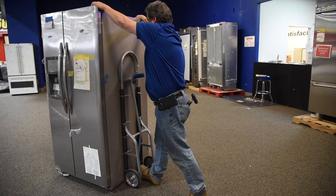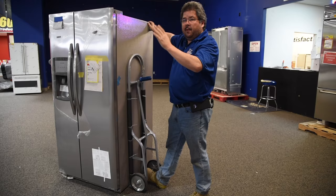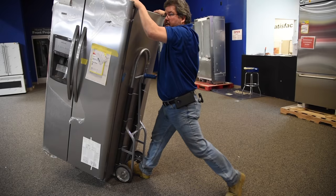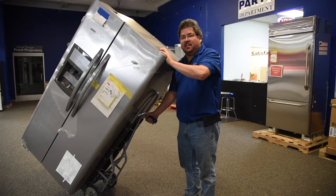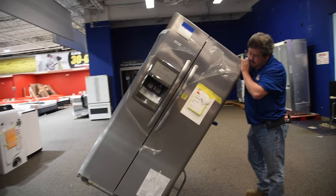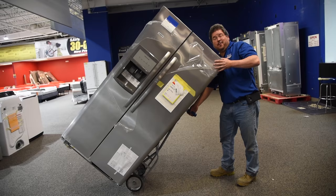Put a good brace on it. Keep yourself good hand holds and you're going to want to pull it back. You see how it wanted to go that way? That means I'm not centered properly. So I want to move my dolly a little more towards the direction it wanted to fall. Now that I'm here, get your good foot hold, get your heel planted, and basically it's going to be pull back and lean back. Once you get there, get your foot back under you and bring it up. There is a balance point — I can do anything I want with this just by using my arms when it's balanced right. If I'm holding it down low, all the weight is on my arm, which means I'm going to hurt myself.